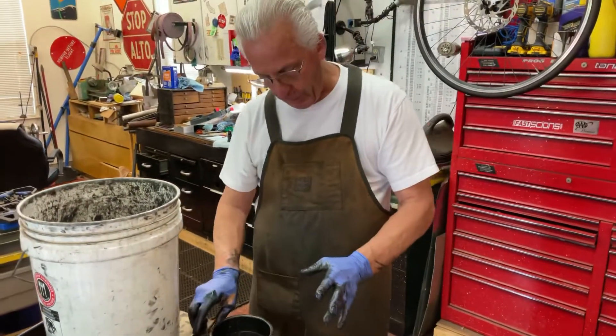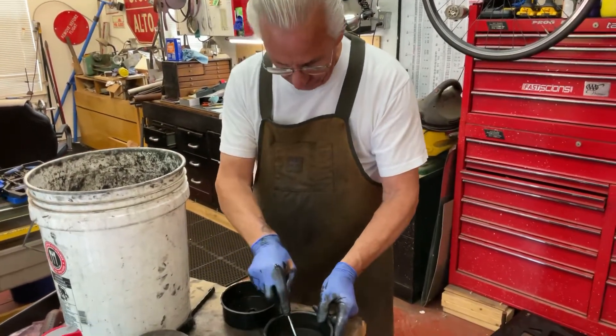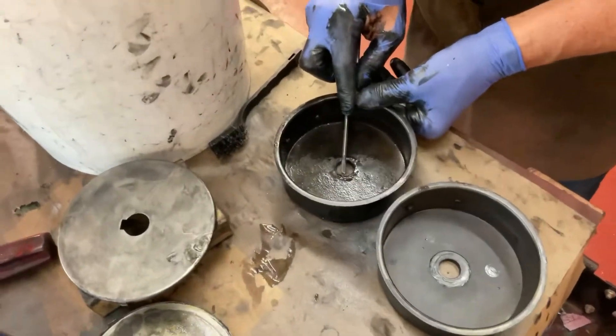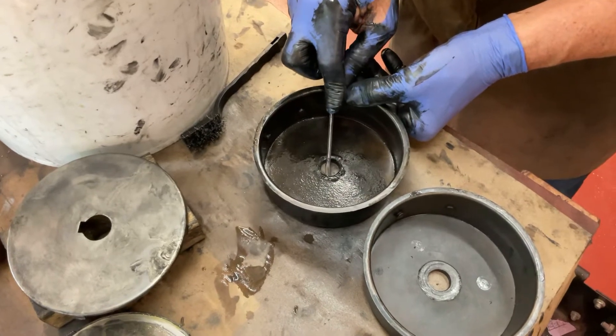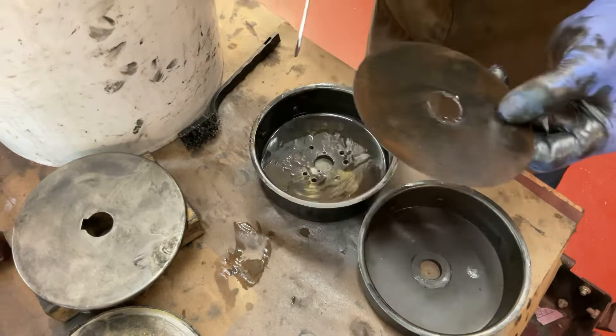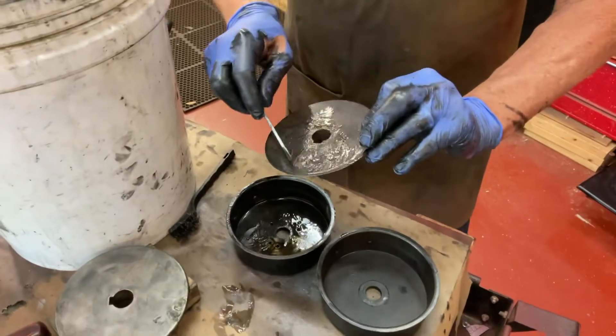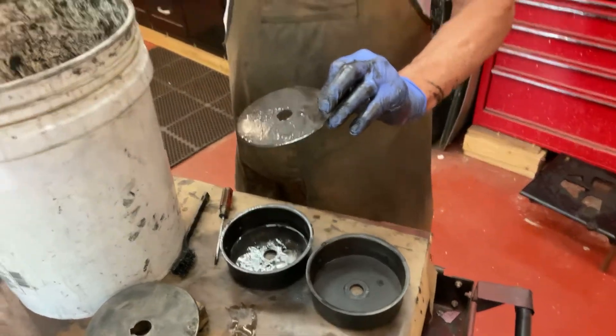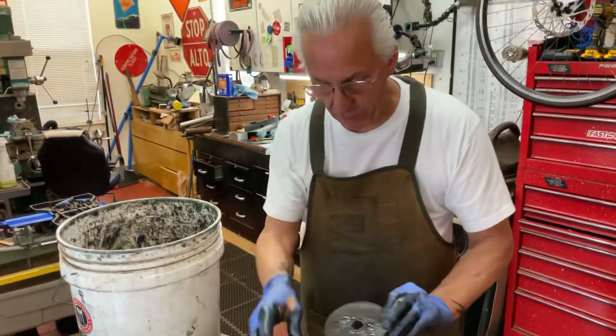I give it a little shot of WD-40. Then I take a small screwdriver and you just come in here, and you see how that lifts? You can just literally pop that out. You don't want all this oil and crap in here because we're going to repack it and the oil will penetrate again into the paper.